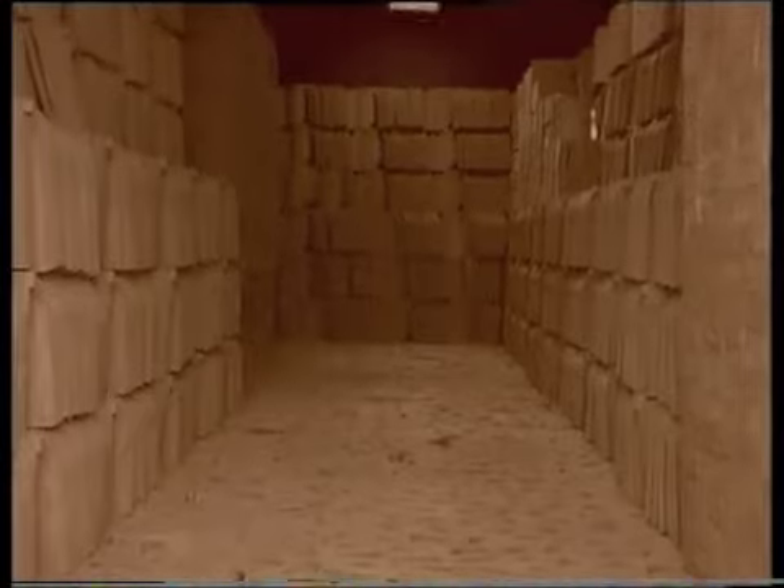Then the tiles would be stacked on top, and when the kiln was full up, we'd have to brick up the entrance door and cover it all in pug. Now, pug was quite simply mud, or warp as we used to call it. In the old days, you'd collect it from the river's edge and mix it with sand to make a very crude form of mortar. There are still roads around here called Warp Lane — I suppose that's where they used to collect the mud from.